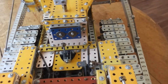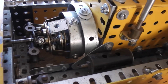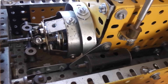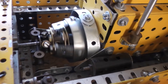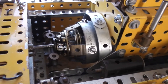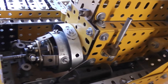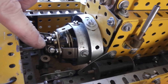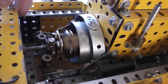A little bit of detail about the model. This is the clutch mechanism. When I push the clutch lever, you will see that the clutch plates just slightly move away — I'll show you that with the engine running. The engine is still turning over, but the mechanism is stopped. When I release the clutch, these two levers here will move back and put force onto a rubber tyre which is sandwiched between the clutch plates.